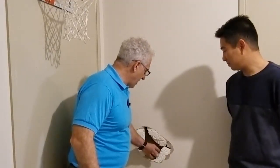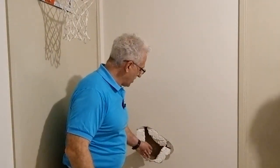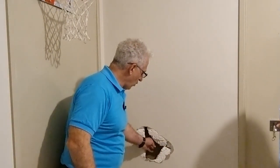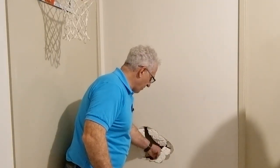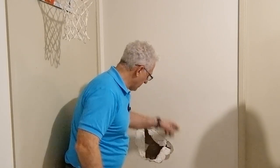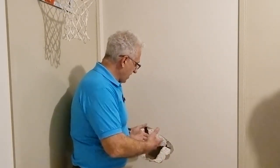There's a bit of an issue with this area because it's a cavity sliding door. Brian, if you can just open that door — you can see the door goes well within the back of the plasterboard. So what I've got to do is put a piece of timber inside, cut all this area out, place a new piece, and then repair it.